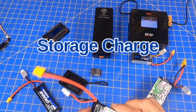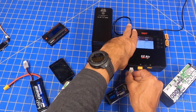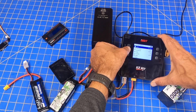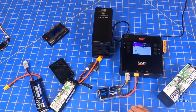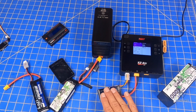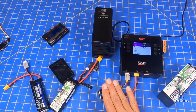Let's talk storage charge. I have a couple of different ways of doing this. I can either discharge on my charger — most good chargers will have that option. I go through the system, come up to task, select storage charge, and it's set up to start discharging this battery, bringing it down to that proper voltage of around 3.8 to 3.85 volts per cell. This system will do it and will also balance as it's doing it. If one cell is not cooperating like the others, it will continue until it does a balanced storage charge.